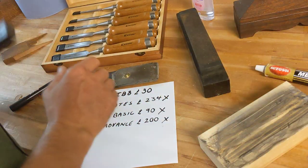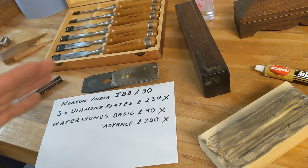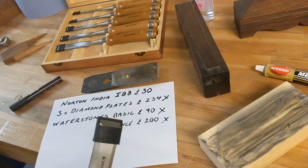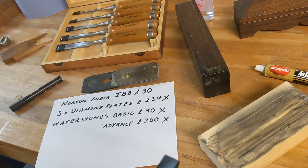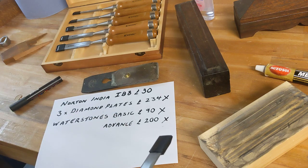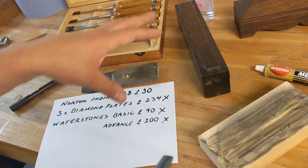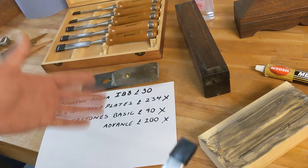So there's lots of ways that you can prepare a chisel, but I just wanted to do that quick 1 minute video with no added guff, just to say, look, if you've bought chisels and you need to sharpen them, each chisel has the potential that it could be done within a minute, and that was for an inch one. I would say if you're taking longer than 5 minutes, the tool you've bought is defective. That's personally what I would do, and I would be in contact with the manufacturer, whether it's cheap Amazon stuff or the most high-end stuff you can get, or the sharpening medium is wrong or your technique is wrong. So yeah, it really shouldn't take too long.